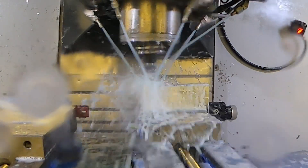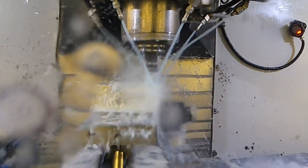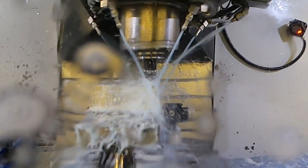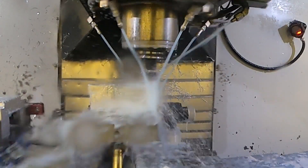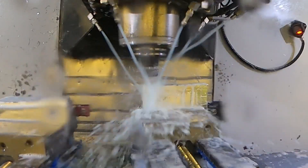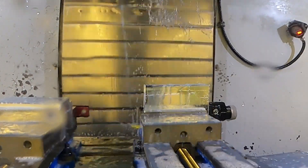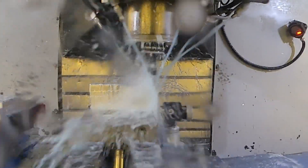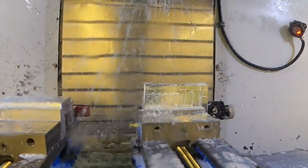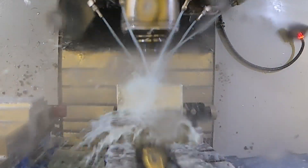On this setup right here you're looking at the back of the plate on one, the top of the heat plate on the next, and the bottom of the heat plate on the one after that. Now it's drilling four-millimeter holes for four-millimeter taps that go in the back and hold the heat plate caps on the back, covering the thermocouple and heat plate on the back of the heat plates.